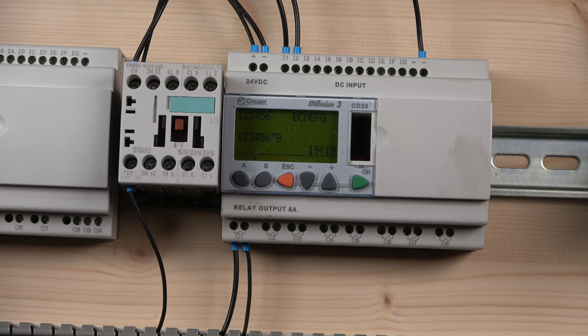Exactly what we created in the software — a small program to set and reset Output 1. Put the controller into Run mode: go to Controller, Run, click Run, and now it's spinning again. Press the green Start button and there we go — Input 1 activates and the output latches on. That ladies and gentlemen is the review of the Crouzet Millennium 3.